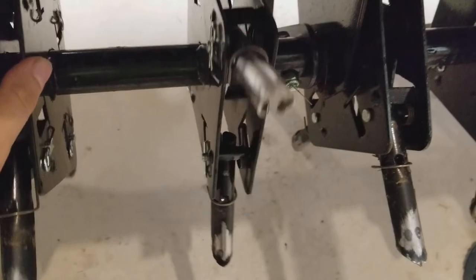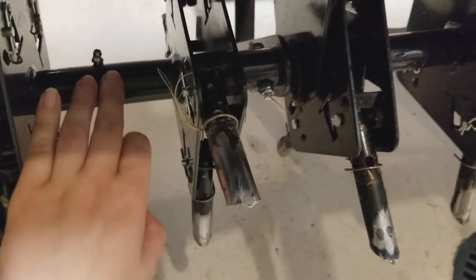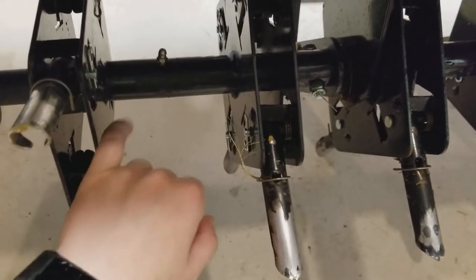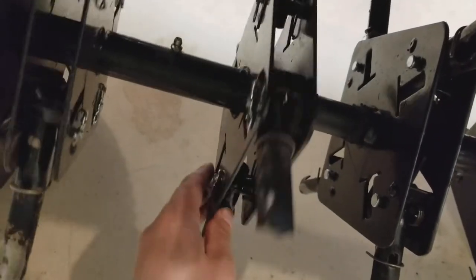In the assembly video, I did mention that these just have plastic bushings on them. From the factory, there's no grease fittings in any of these spools. I went through all five spools, drilled and tapped them, and put a grease fitting in all five. You can see it there on that one.